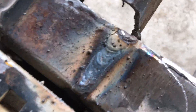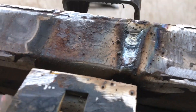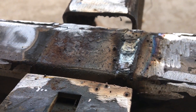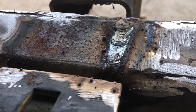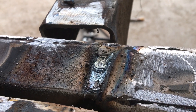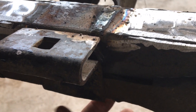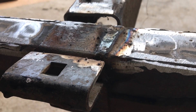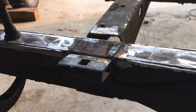So we have come by with our first hot bead and we have filled the crack. That's not to full strength, so now it's time to work on the gussets. Just to reiterate — I could not access that crack the first time because I didn't go ahead and cut off that top strap. But with that top strap out of the way, I was able to get good penetration on three sides of that. The bottom had not broken yet, and neither had the bottom corners — though there might be a little distress in that bottom corner. Now it's time to grind down those welds and prepare some gussets.